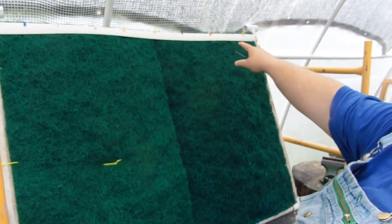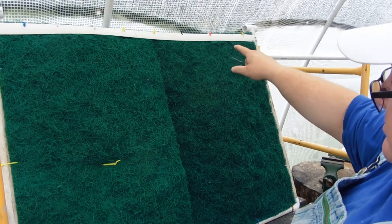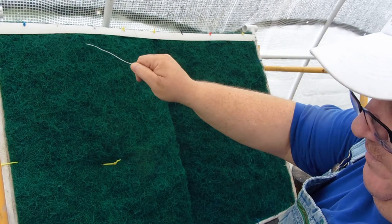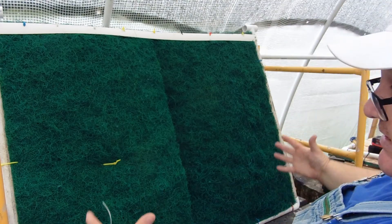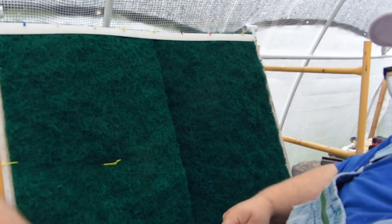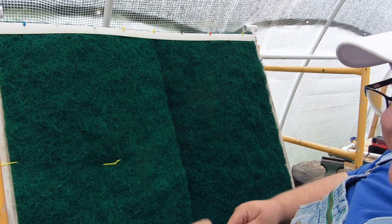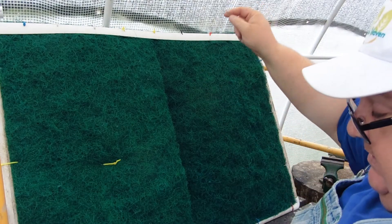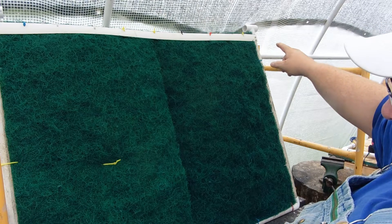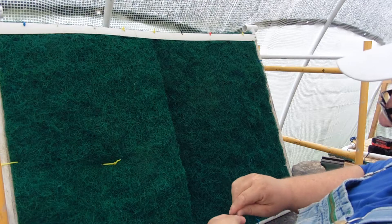You see that little plastic piece up there — that's what was left from cutting the pipe. I screwed it on each end, drilled some holes, and that's what we attached it with. The reason there's nothing running across the top is that there are three-quarter inch tees up there. Once I slip this in, I'm running a half-inch pipe all the way through the top and out the other side, with a screw cap on the end. There are small holes in the top where water can drain down. I want to be able to drain and clean the water line.